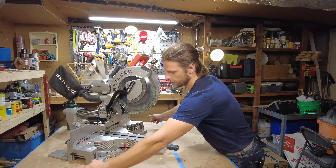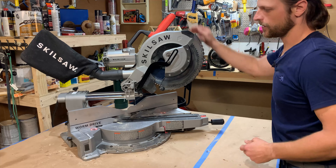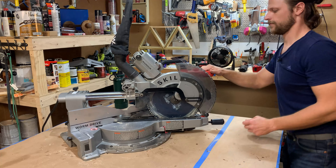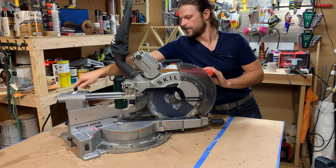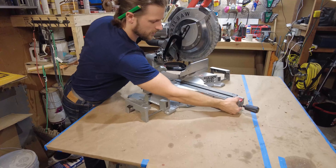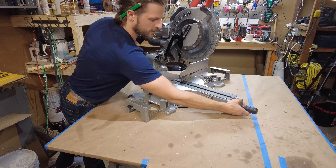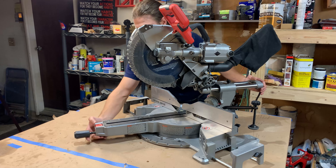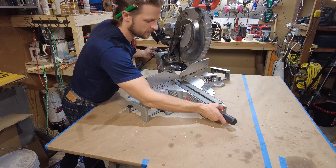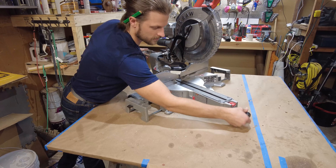When you collapse it for travel, it really does get pretty small. Bring the feet in, turn the miter saw to 60 degrees to the right, bring it in, take your slider all the way down, lock it in, and tighten it up. There's also a detent lock — press it in to release the detents and turn the saw; it'll lock at common angles like 15 and 22.5 degrees. For an odd cut like 10 degrees, you can go to 10 and clamp it down and it won't move.